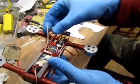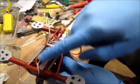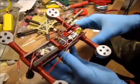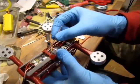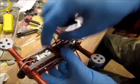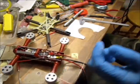Before I power up, I have to do the antenna on the VTX because everything is soldered. If I power up without an antenna, it'll be a nightmare. Might have a little magic smoke or something. So it's not going to be replaceable. Squeeze that in through, and once the antenna is in, that's it. The only way to replace that one will be to desolder or snip the antenna and solder again.